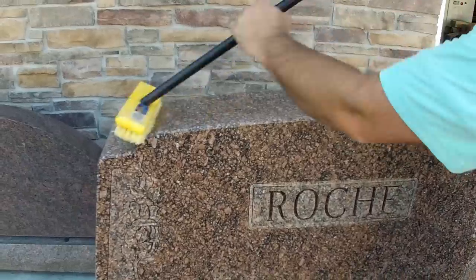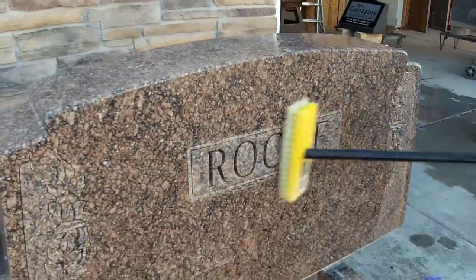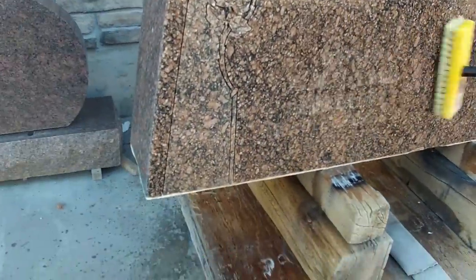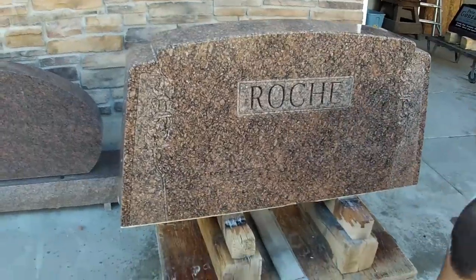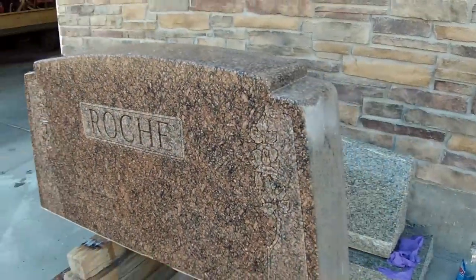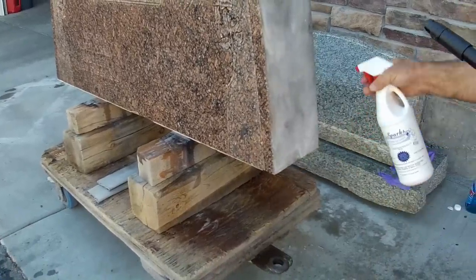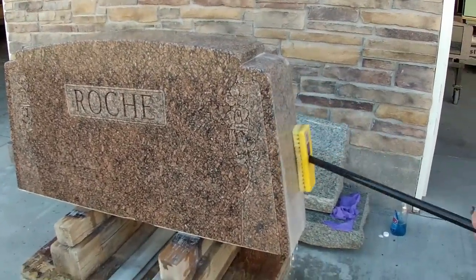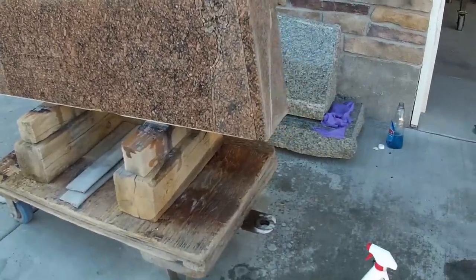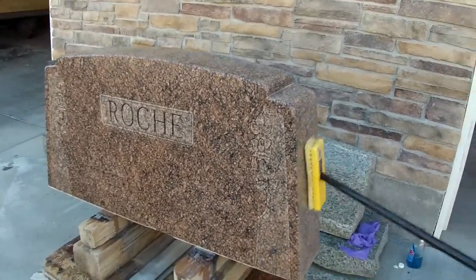Get the minerals off. The top of this stone is sawn but smooth. You can just go ahead and work your way down. If you see something foam up, you can hit it again if there's quite a bit of buildup. Go ahead and get the sides — you can see the sides how bad they are, how built up it has become. I bet we've already cleaned the front and the top of this stone, and we've only used maybe a quarter of that bottle so far. If you were to pour it straight on, it would just run right off onto the ground, and you'd probably only get one cleaning per bottle. That's why we recommend using the spray bottle.